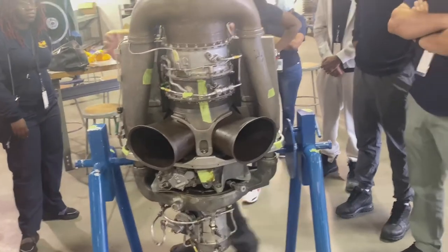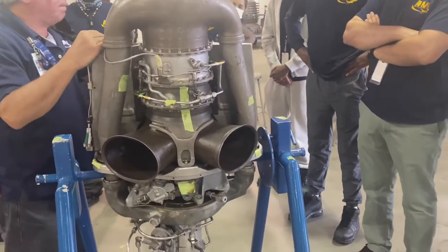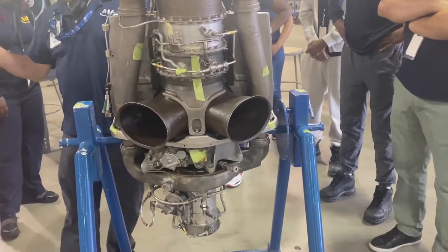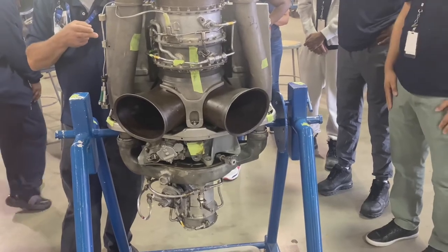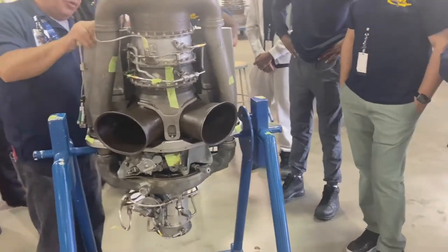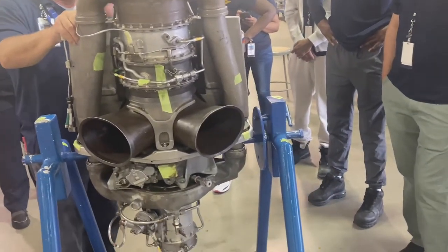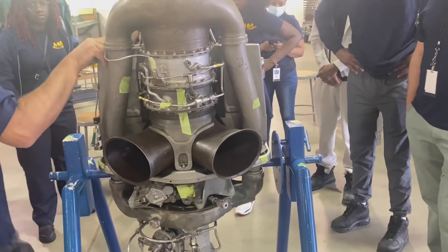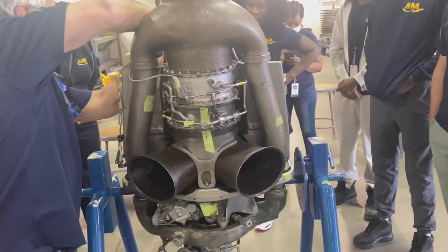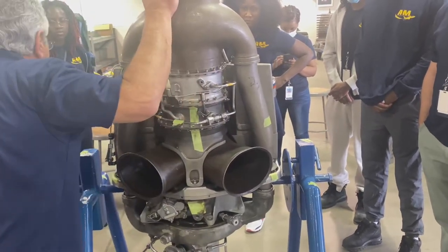When you take things apart, take pictures of it before you take it apart, okay? Take a lot of pictures. Take all the pictures you want, but I want it put back together the way you see it. Also, you're going to mark things, like everything, how it goes. But more importantly, when you start to reassemble things, I don't want you to put one bolt and washer here and then tighten it as hard as it'll go and then try to put the rest of them in, because you'll never get it in.